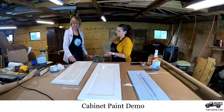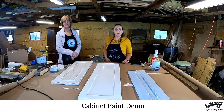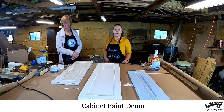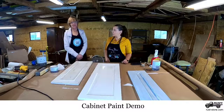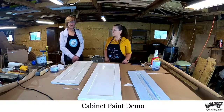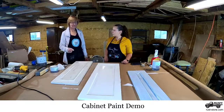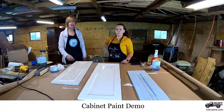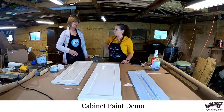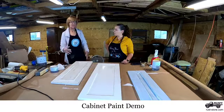So, Jody asked, is it safe to say that after waxing, if you see something that needs a little more distressing, you can? Yes, you can always distress more. If you over distress, I would take real fine grit sandpaper and go over it to get some of your wax off, then touch up the spot, let it dry, re-distress how you want it, put some wax on, and it'll blend right in.